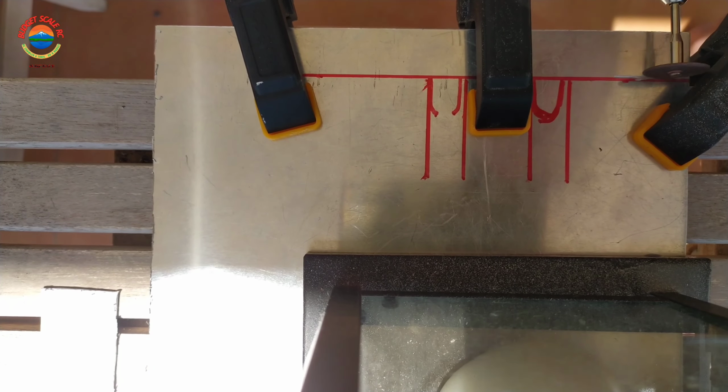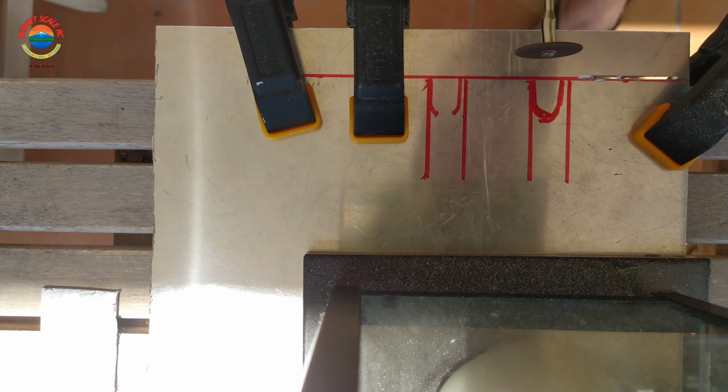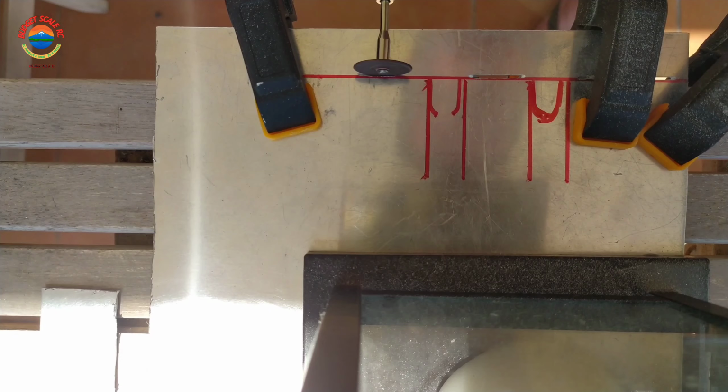At the beginning, I used a 1mm aluminum sheet, the same used for the custom shock mounts. As I suspected, aluminum does not like to be bent, it cracks, it breaks a lot.